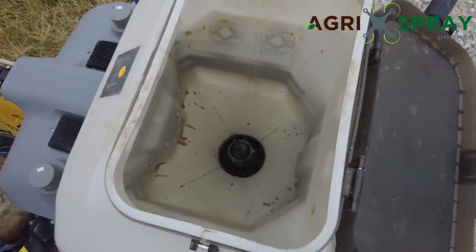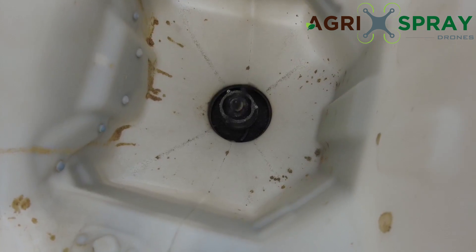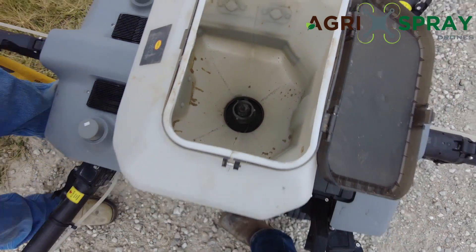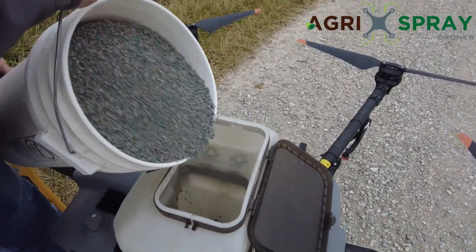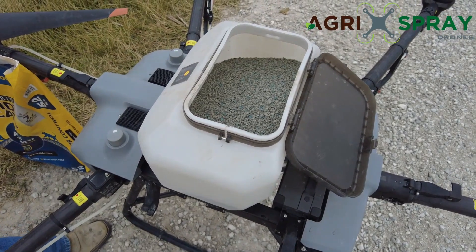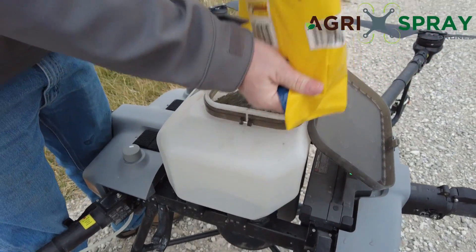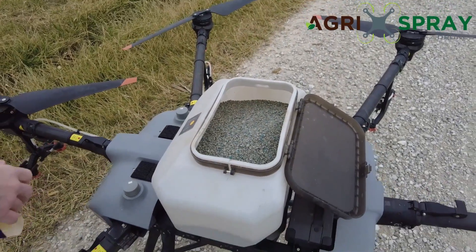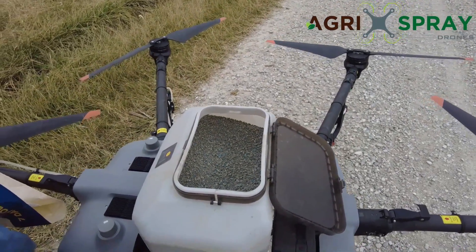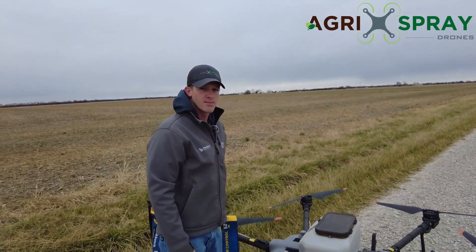Now all we have to do is dump in our kitty litter. You'll notice on the spreader, at the bottom of the tank, you have an agitator that spins all the time to sense whether product is down there or not. Then you have another agitator below that which spins whenever the gate is open. Underneath that you have a gate. The T30 has a nice large opening, easy to dump either bags or buckets into. We've actually had some guys use a seed tender. That right there was 52 pounds — you can see we've got extra room left. We find you can dump about 65 to 70 pounds of product into this granular tank. The capacity is 40 liters, which translates to about 70 pounds of granular material.